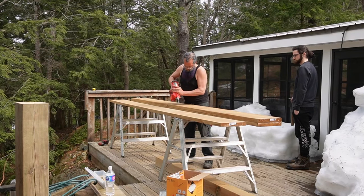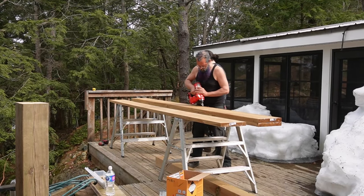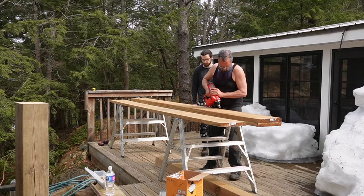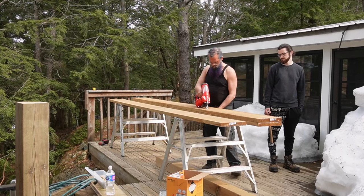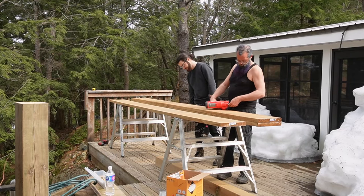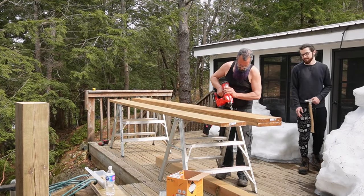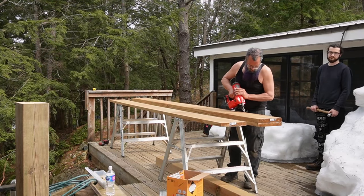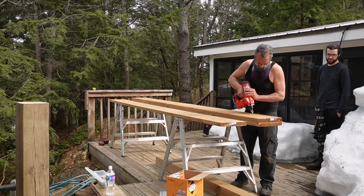I'm shooting the nails in and it's going pretty quick. This whole video is real time by the way — I haven't sped it up. When you're first starting to nail your beam together you generally have to get your gun dialed in a little bit for the depth that it's driving the nails. You want to make sure you're not shooting the nails through the other side — that means getting used to shooting at the right angle and having your drive depth set just right on your gun, then you get everything nice and clean and you don't get a pokey stabby side of your beam.